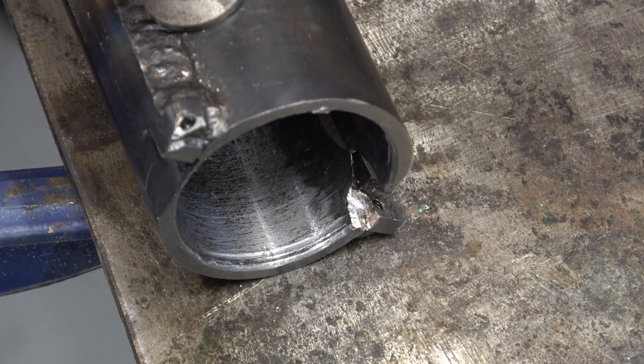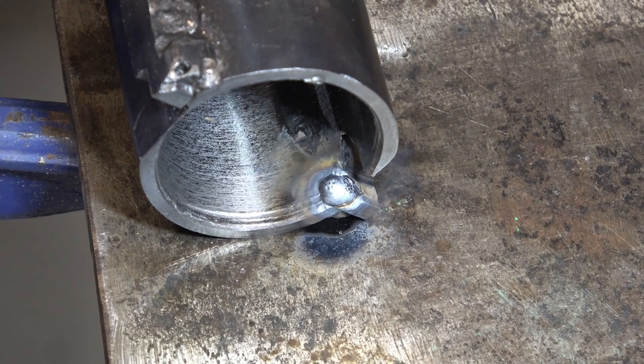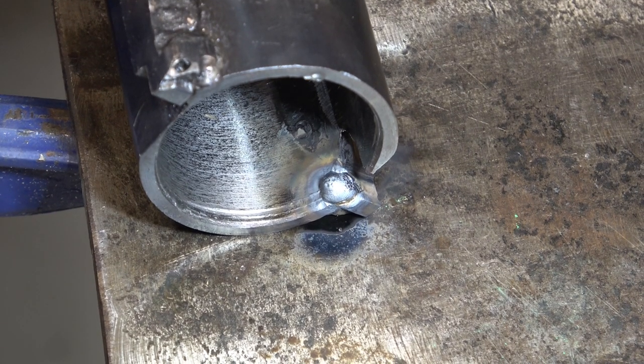I've chopped that bronze out with a chisel and now I'm going to re-weld it in steel. Well, a 2 second blob of TIG with mild steel filler wire, and I've effectively extended that shelf where the carbide is going to sit. So now I'm going to put a screw into the existing hole to block it and then try and re-drill it. And then to finish this, quite possibly I'll do it with a file. I'm not going to set up the milling attachment again.